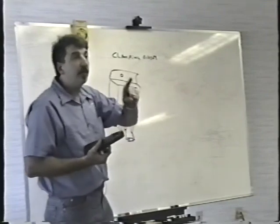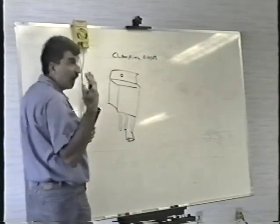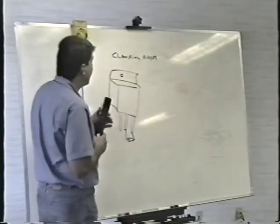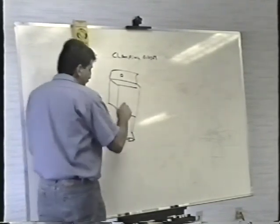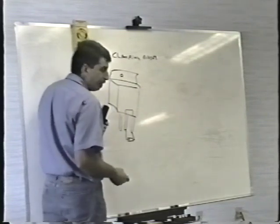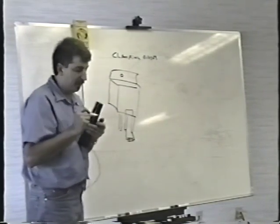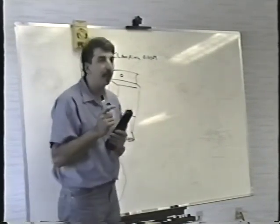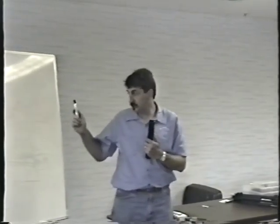Okay. But what this also means is this, very important. There's a reasonable chance that your clamping diode is the thing that's shorted. The transistor might be shorted from collector to emitter inside. Or the clamping diode might be shorted, or they both might be bad. So listen carefully to what I'm saying here. When you check the transistor from collector to emitter, if you find it to be bad, the meter will show a short circuit.